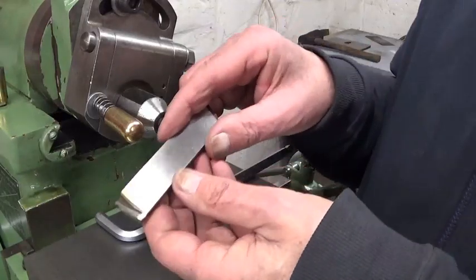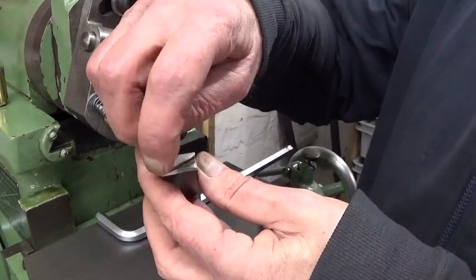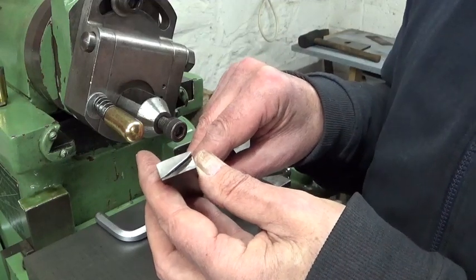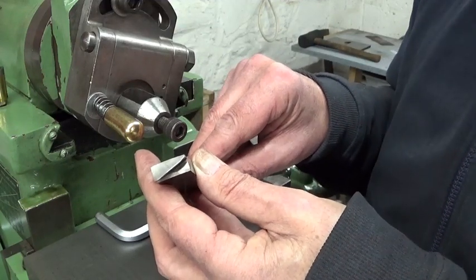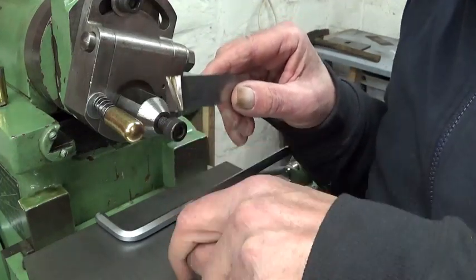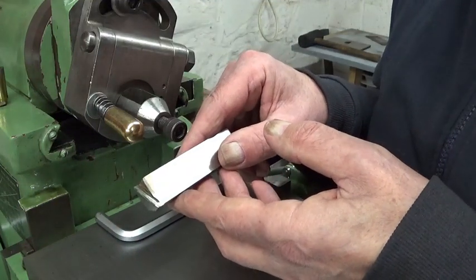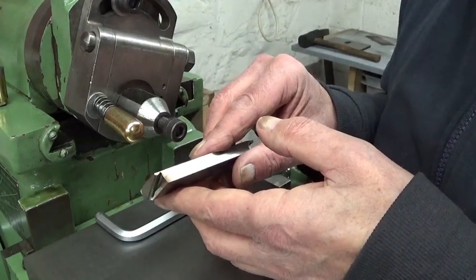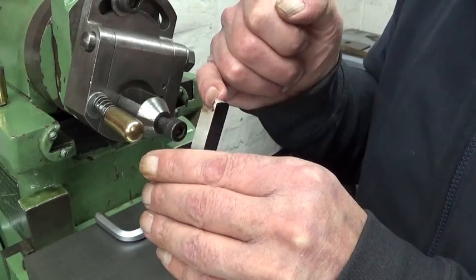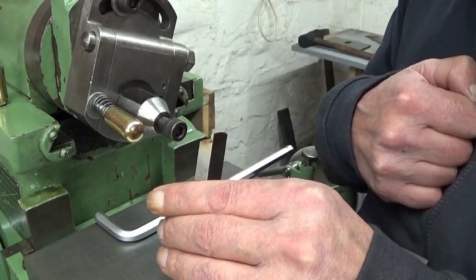And here's the shear tool I just made. It has a cutting angle of 70 degrees. So normally in the books it's marked 45 degrees, but I've seen that for this soft steel 45 doesn't work. So we're gonna give it a go with 70 degrees. And also, of course, a little bit of rake. I suppose this is the rake angle.